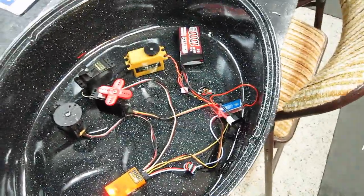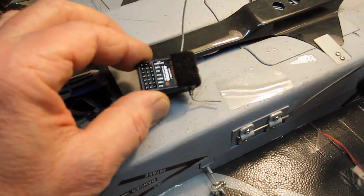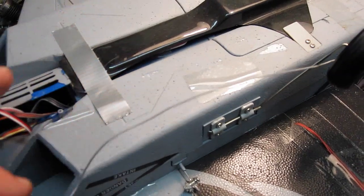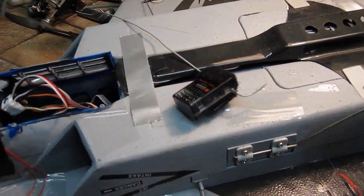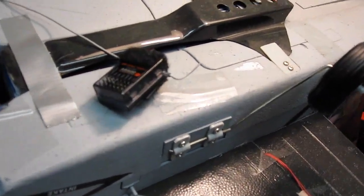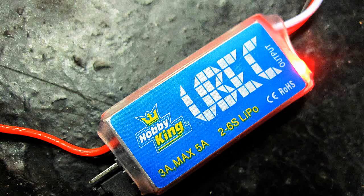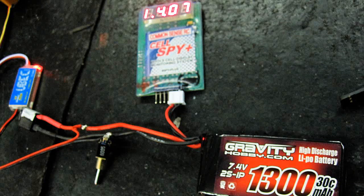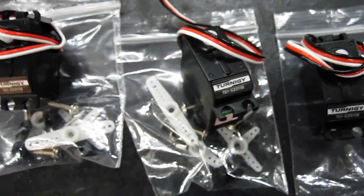The other part of the test is over here on my night flying F-18 Tiger. I've been flying with the AR500 — it has the longer antenna on it. I've removed it and I'm going to give the same range test to that receiver as to these orange receivers. I've been using the three-amp BEC, this U-BEC — battery eliminator circuit — for several hours, stressing it, loading it, cycling all the servos on and off. It has not missed a beat, so thumbs up for that one.